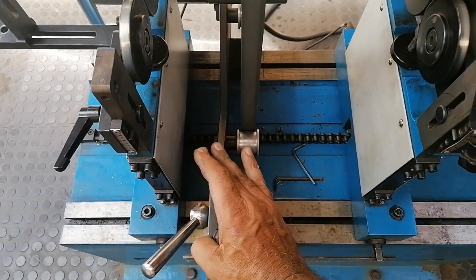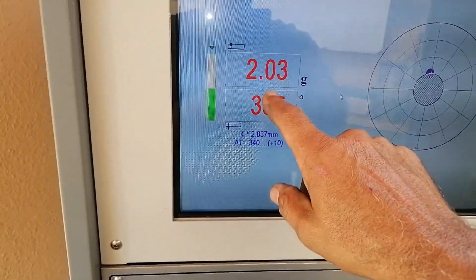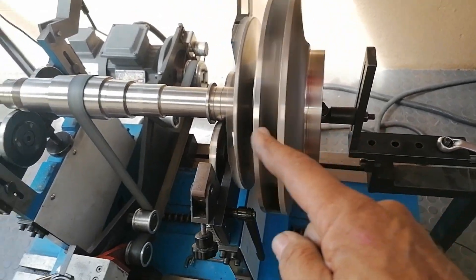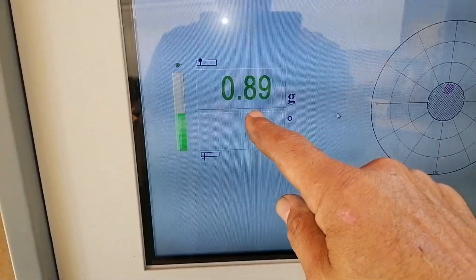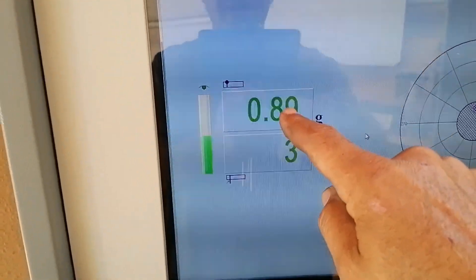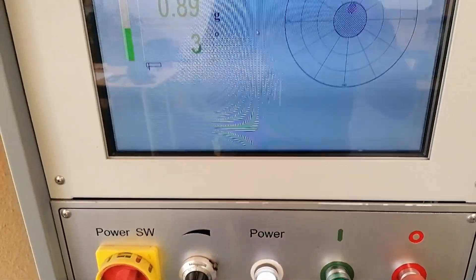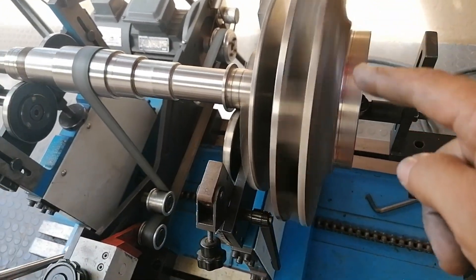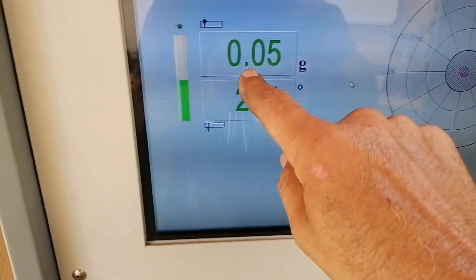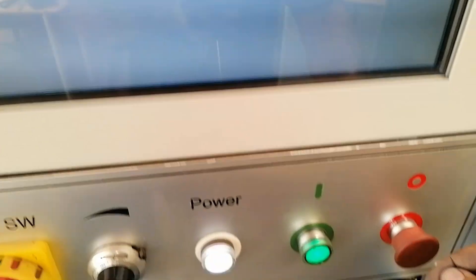She didn't come down much - I must obviously grind much more, so I'll keep working that area. After the third grind I'm down to 0.89, which is acceptable, but I'm going to bring it down to less than half a gram. After the fourth grind, I put it back on the machine - running at 500 revs, everything's good - she's 0.05 grams out at 224 degrees. This is as near as damn it. Let's stop this and print it.